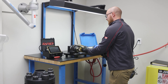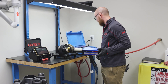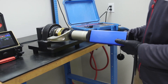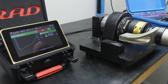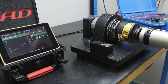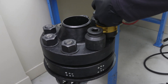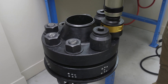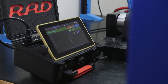Now we're going to redo that test but with the E-Rad S features enabled. Back on the standard calibration joint: 532 foot-pounds, set for 500. Moving again to the flange: 508 foot-pounds.